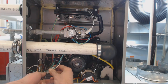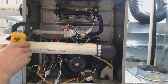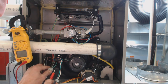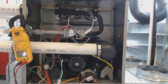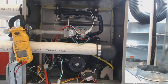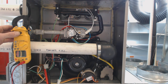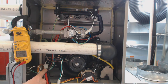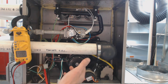What we need to do is disconnect this and see if 120 volts is coming through these wires. We can come in the back so we don't have to have our hands near it, then go ahead and call for heat. We'll turn our multimeter on to check for voltage. We're calling for heat right here — the hot and common wire — and we're reading 122 volts going to the inducer motor. The main problem is the inducer motor is not turning on.